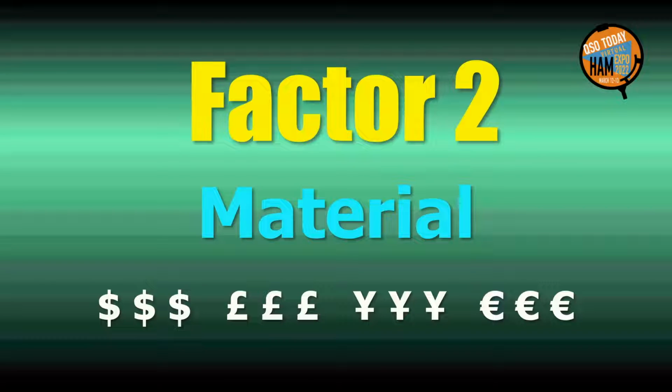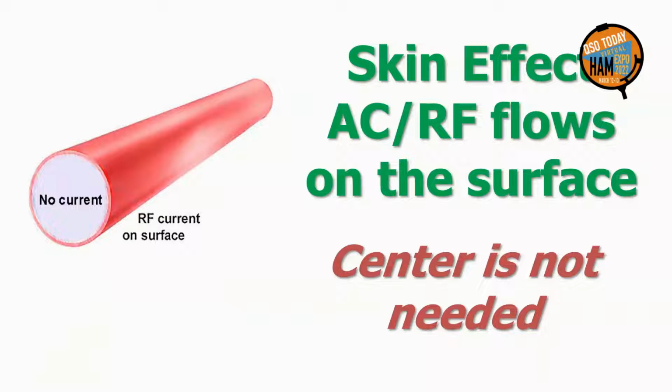The second mag loop optimization factor, the material from which one builds the loop, offers considerable cost benefits, particularly for the home builder. This optimization is caused by skin effect. As many hams know, skin effect is the tendency of alternating or radio frequency current, illustrated here in red, to run only on the surface of the conductor, here solid aluminum wire. In the center, there is essentially no current. Said another way, the center of the conductor isn't needed.